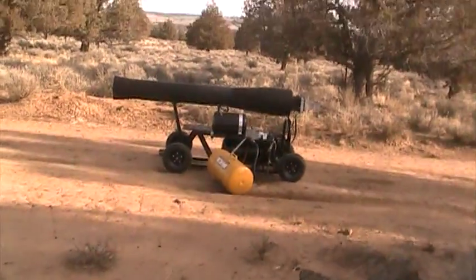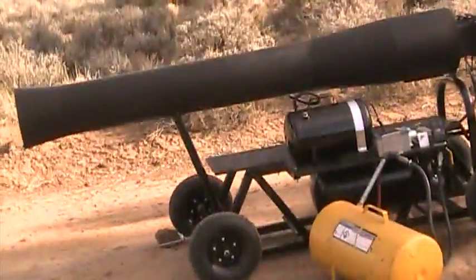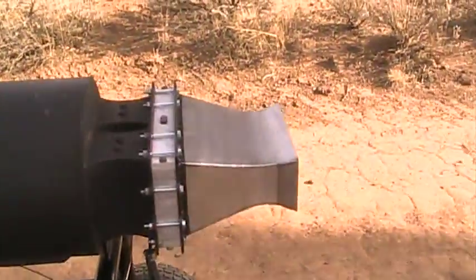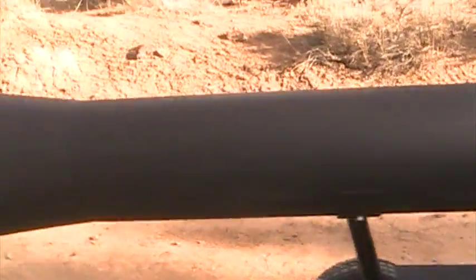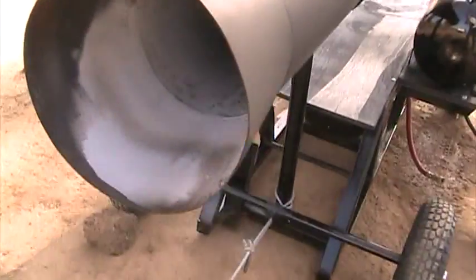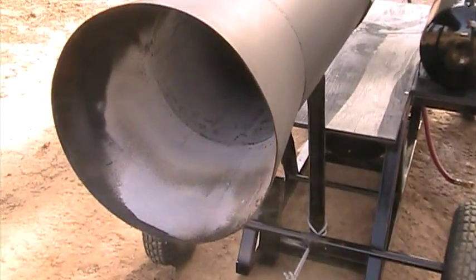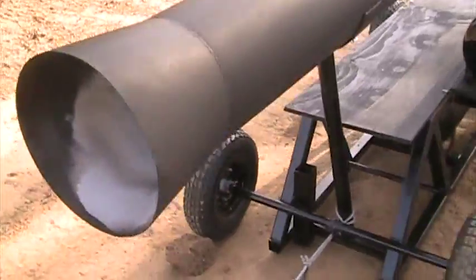Let's look at what's going on for running here. This is my 300-pound thrust — basically my standard motor. I just did a nice hot run with the black paint on it. Looks like it worked perfectly. You can see a little white inside — that's just because this engine had been painted with powder coat, and a little bit of that is still left in there. Of course, that stuff just burns off.